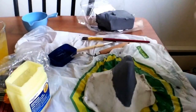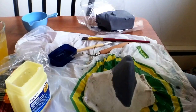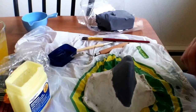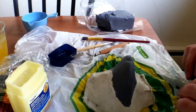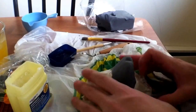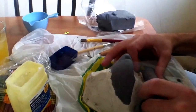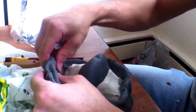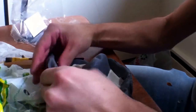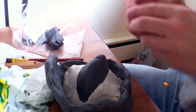Once again, as in previous videos, we're just going to be making a clay mould wall. I started off by taking the oil-based clay, rolling it into lengths, and just positioning it along the very bottom side of the plaster cast of the chin. I wanted to leave a nice gap between the actual sculpture of the prosthetic and the edge of the mould, because I wanted to have a nice seal when we put it back together later. I've built up the base of the clay wall and I'm going to carry on building it up until it's at a height above the prosthetic sculpture, because when we pour the plaster in, we want the clay wall to be higher than the actual sculpture so that the plaster will go above the sculpture.